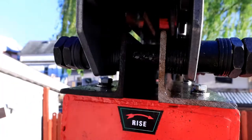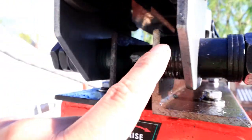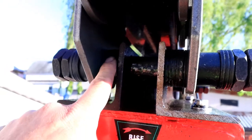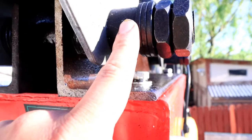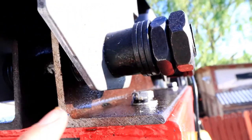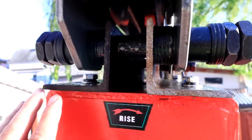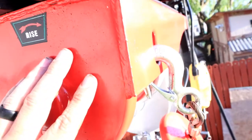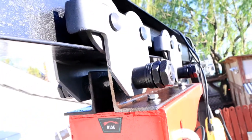These trolleys also came from Harbor Freight. They come with a piece that goes all the way through, and you can see it has spacers. These spacers came with the trolley as well. This spacer here — I actually had to cut that in half for both this one and the one on the other side. So I did have to make some modifications besides actually building the bracket. In the end it works out pretty well, and the trolleys are each rated for one ton. This is going to safely pick up a ton, especially since the gantry crane is also rated for one ton.